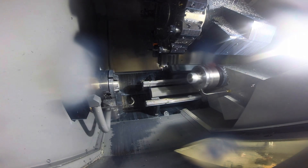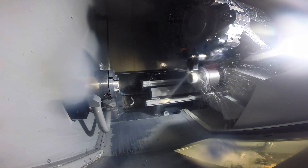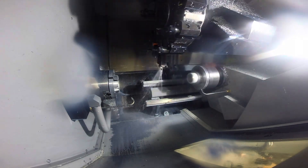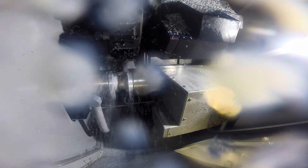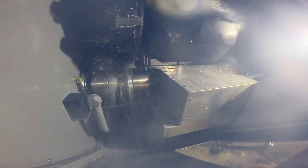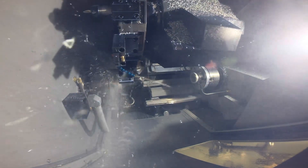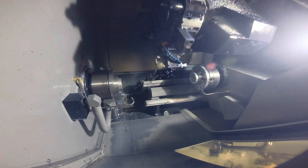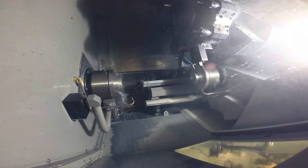There's the rear turn and bore. Now it reverses the spindle to do the parting or grooving tools because the grooving tool is used on both the front and rear sides, so the tool isn't flipped over like most of the rear tools. There it's done the first handoff, machined the second side, and it's about to do the next handoff. Now it's going to hand back to the front spindle, then part down the middle, and then finish both sides. You can kind of see what's going on despite the coolant on the lens. The parts have been cut in half and it's just going to finish both ends - turning and boring on each part. Pretty efficient at this point - zero operator interaction besides loading and taking out parts.